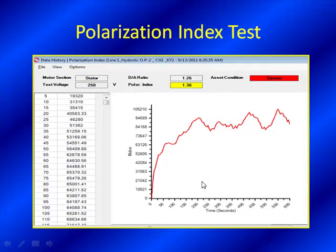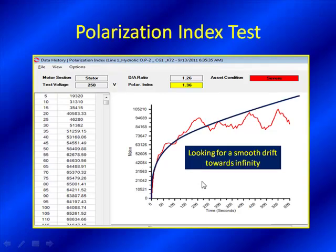We're going to do another look at the insulation — bypass the phase-to-phase and do what we call our polarization index. You can see a graph of what we expect to see versus the actuality. We see some breakdown and choppiness — the classic contamination indication from the polarization index test. Although it warrants attention, this by itself may not have been the primary reason for further investigation; the 33% resistive imbalance and the high impedance imbalance from the Emax are the primary concerns. We're looking at about 80,000 megohms — acceptable values for a low-voltage motor, but we cannot say enough about the importance of the profile graph over just quantitative measurements.